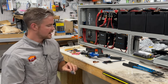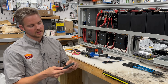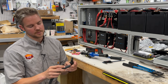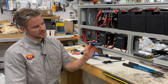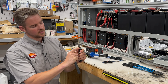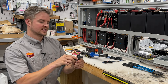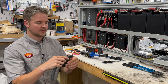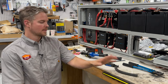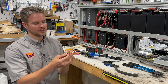Once we've cut our wire, we need to strip off our insulation on the outside. This is one of the tools that we use. We'll have that in the description. This one's really nice. It has a little mini blade that you can dial the height of. And then this just snaps onto the cable, flip it around, and that's going to allow you to take off your ends.